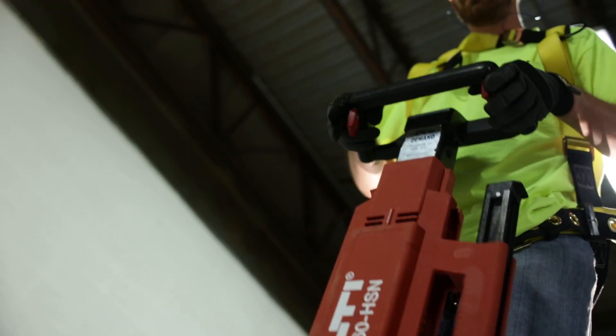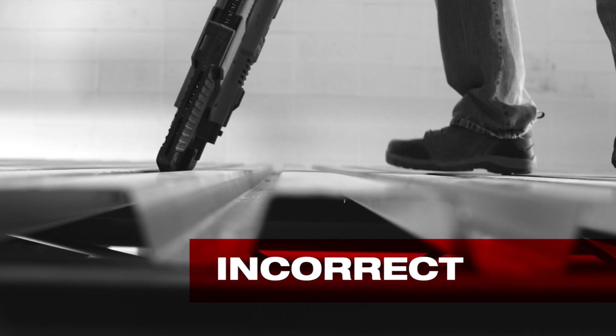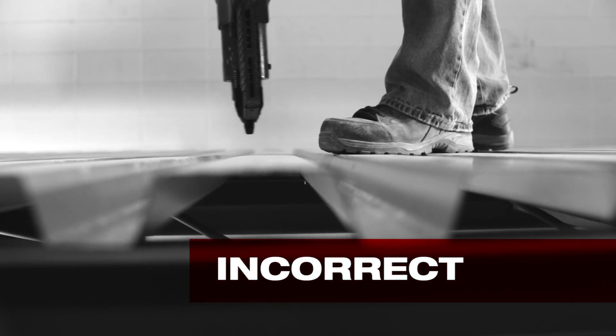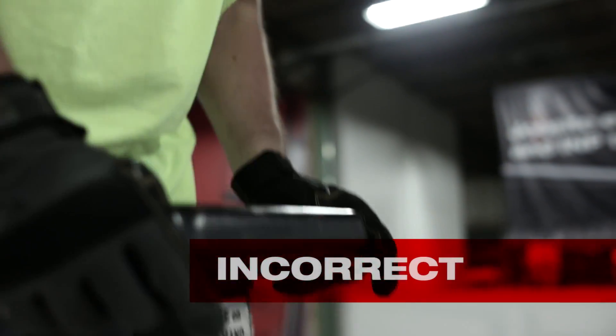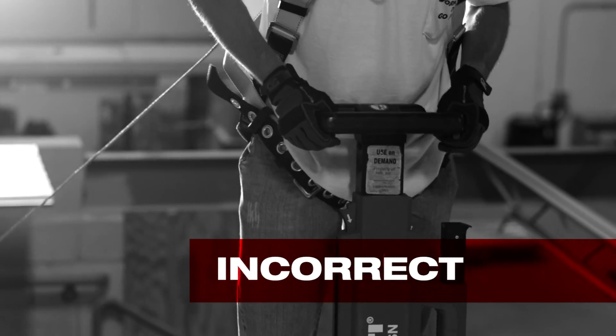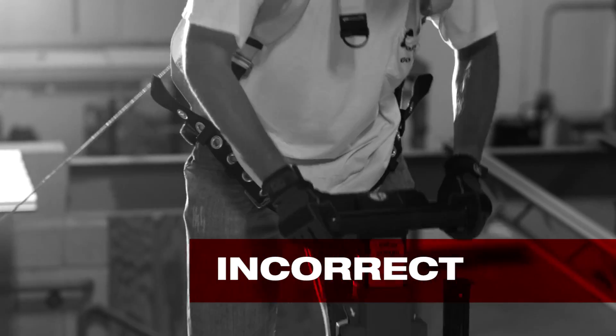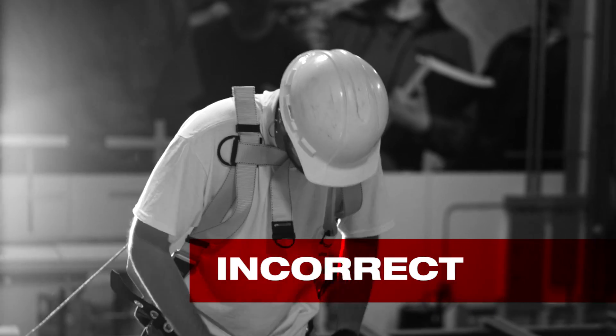Making a fastening at an angle can cause damage to the tool and could cause an improper fastening. Many times on projects, installers can inadvertently pull the triggers as they are compressing the tool. When the tool does not actuate, some operators pick it up and slam it down, forgetting to let go of the triggers on the handle. This action can cause damage to the tool.